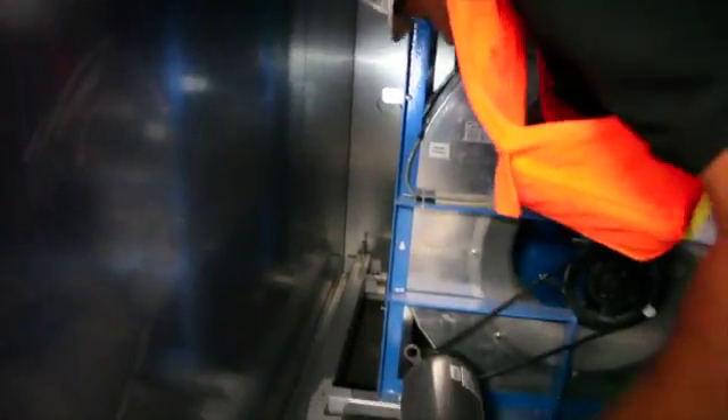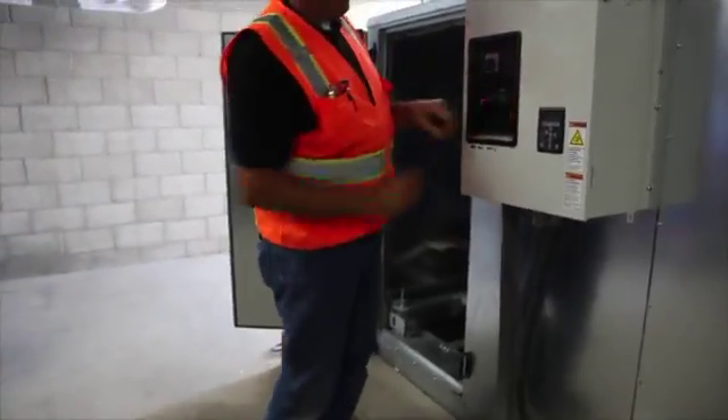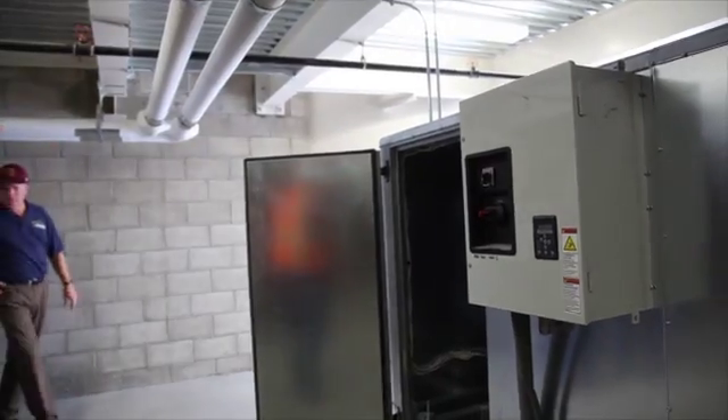Here are the two Zerk fittings, and you obviously have a belt as well. Just be careful because this is an open shaft below — it's an open area. To lock and tag these out, you could push the levers forward and put the lockout/tagout mechanism on the handle.